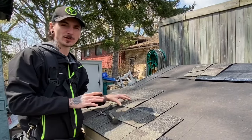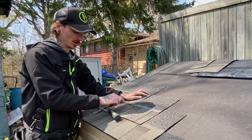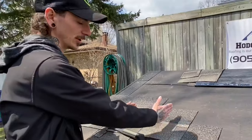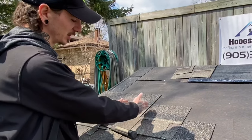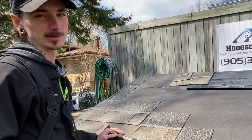When you're shingling your roof and actually installing your nails, always make sure your seam line does not land on top of another nail. If you're nailing this shingle, make sure your nails are always approximately six inches away from the water lines, because those can eventually grab water, rust out, and cause a leak.